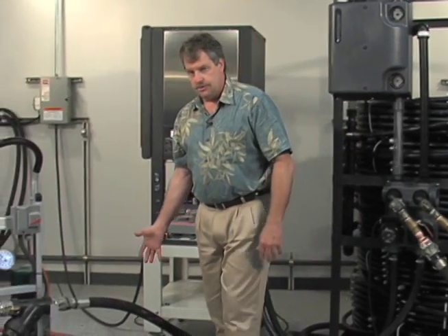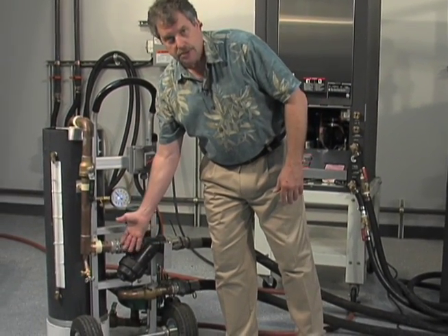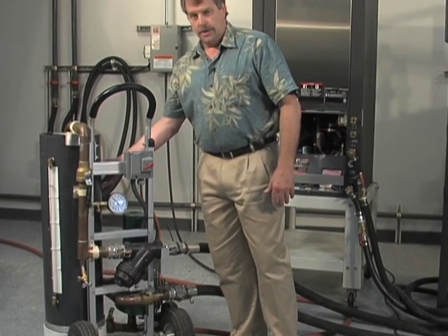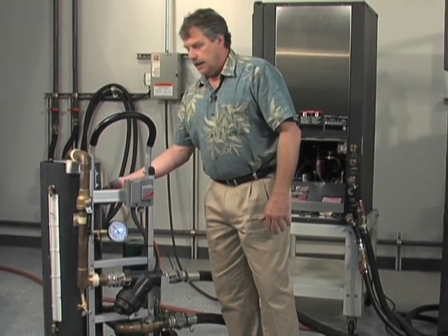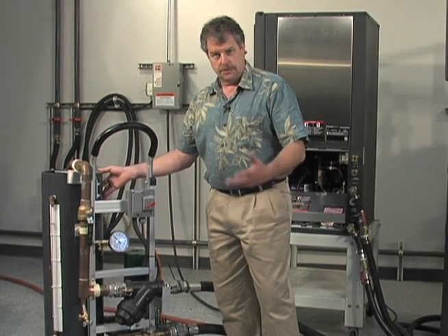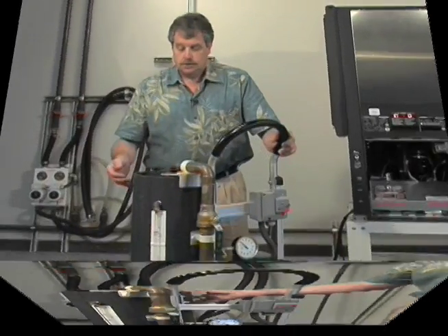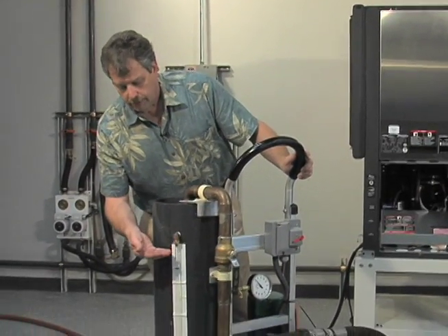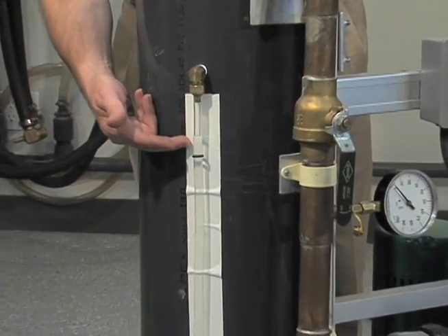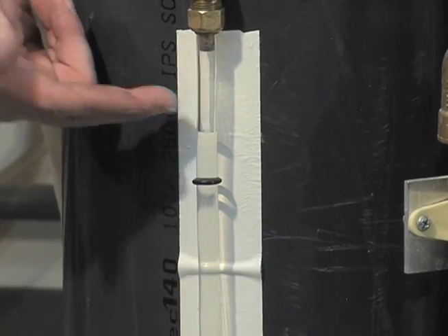This is our return hose here. It's going to come back through our 80-mesh screen and start to fill our reservoir. When the water level gets just slightly above that tee, I'll turn the pump on and we'll start to use the pump to dislodge the air. Now that we've got our water level up in our reservoir, the sight glass lets you visually see from the exterior where the water level is — that's the entire purpose of it.